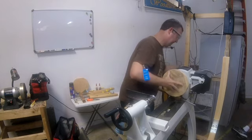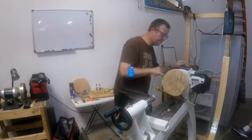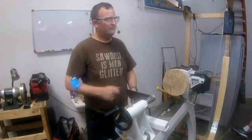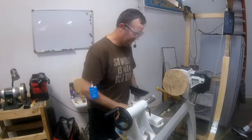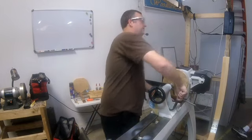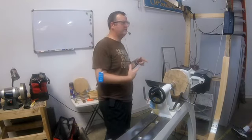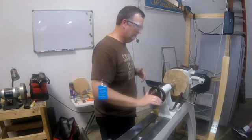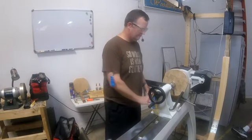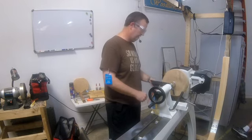Push that in with a twist and it holds up — it hasn't fallen off yet, that's a good sign. My glue's not wet anymore, so the accelerator worked. Now, anybody remember the rules of woodturning safety? Always bring the tailstock up when you start. The other night when I was practicing, had I brought the tailstock up it wouldn't have flown off the lathe — it pushes against that glue joint, helping to set it even tighter.